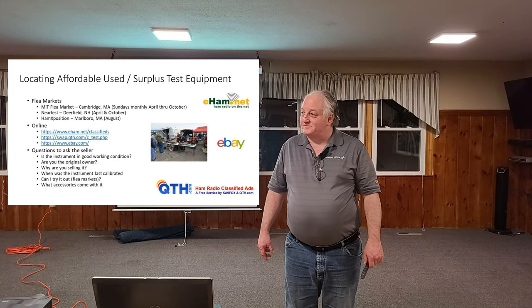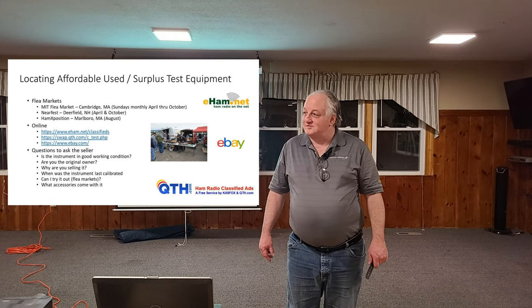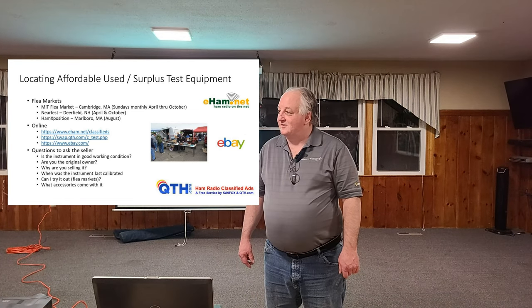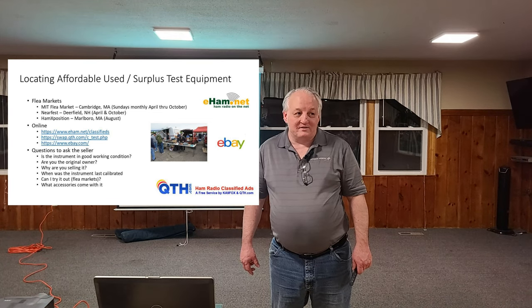By the way, it's a common known failure on 2-element 40-meter Yagis. You make sure that whatever balun you put out there is not going to fail. Use the biggest one you can find. So I replaced that with a 5-kilowatt balun. It never went bad again.